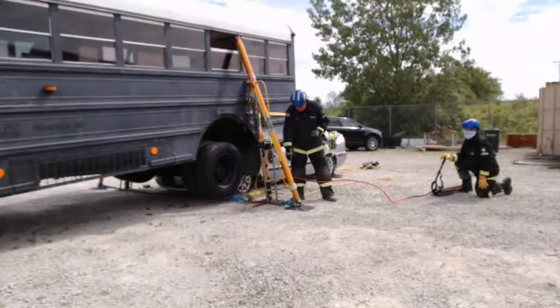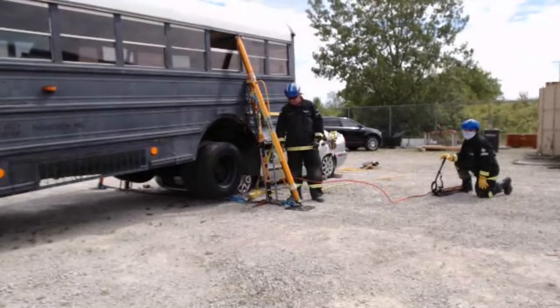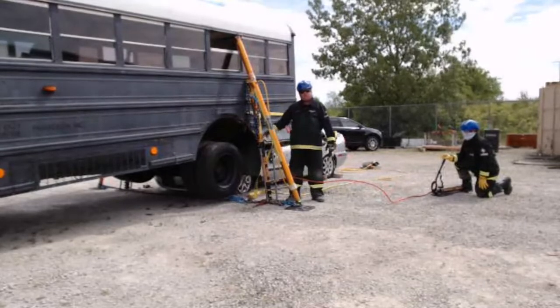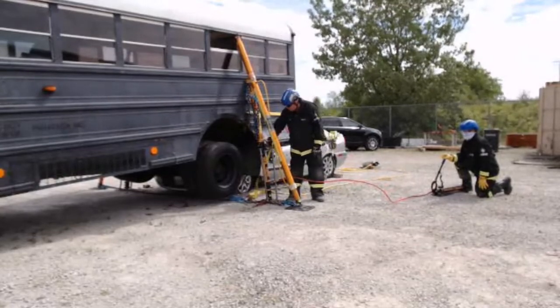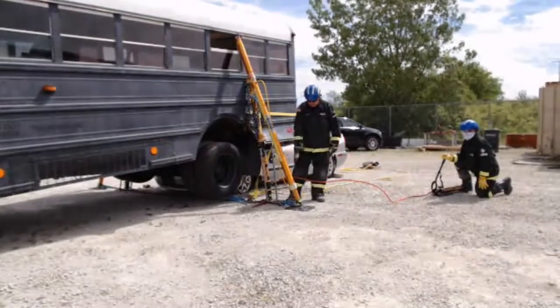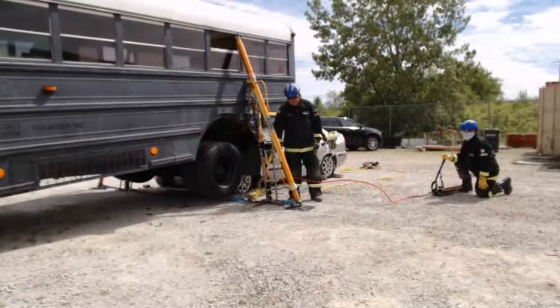And if you take a look, I'm using my slip hooks. I've got two sets of chains here. I've got a 10-foot chain that Mike just talked about with a slip hook going to the other base. Then I've got my 30-link chain with a slip hook going onto my 10-foot chain, linking the other base. The slip hook is going through the anchor ring. Then I've got my chain binder in place.